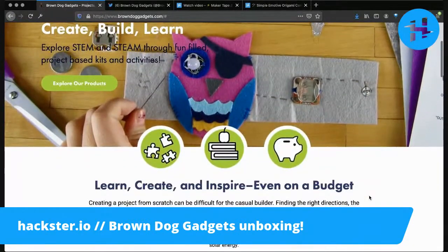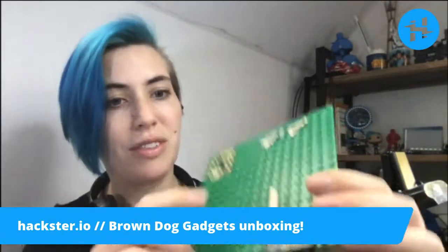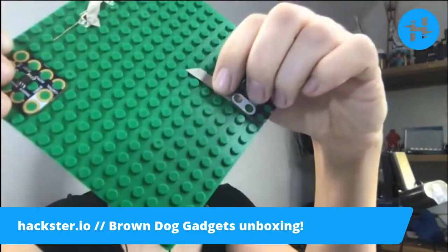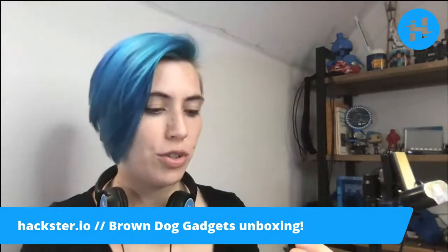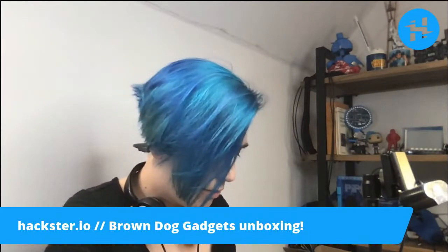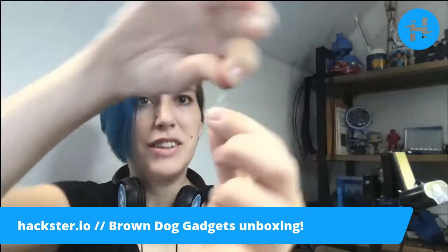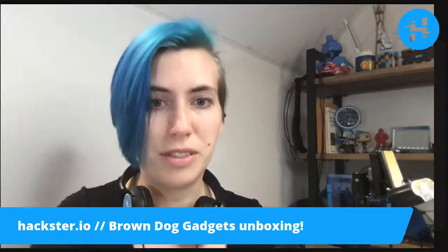They make not only Lego-compatible modules — such as these 555 timers that they sent us a long time ago that I have yet to play with — but also the silver stuff you see on here is a conductive maker tape. It's a special kind of conductive tape which is incredibly flexible and durable. Unlike regular copper tape, it doesn't fold and stuff. You can just flex it every which way, it doesn't break, and the adhesive is conductive as well, so it's conductive through the Z axis.